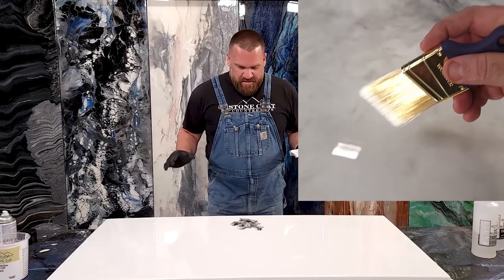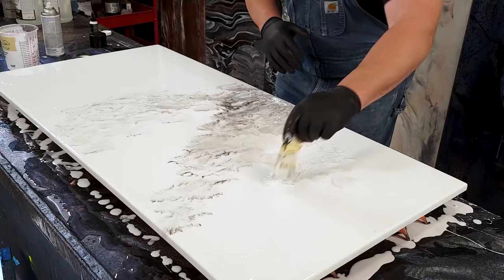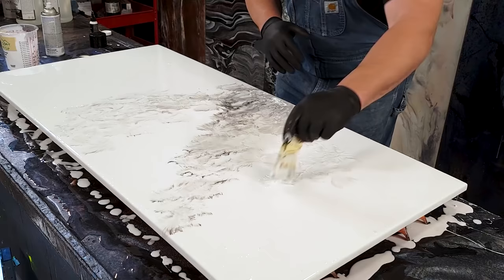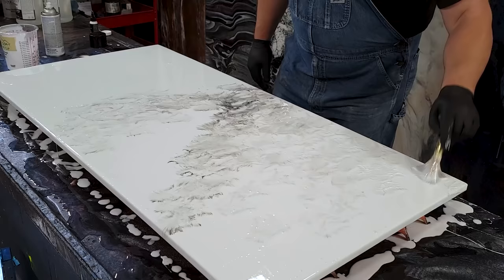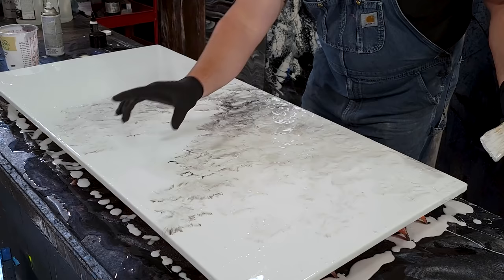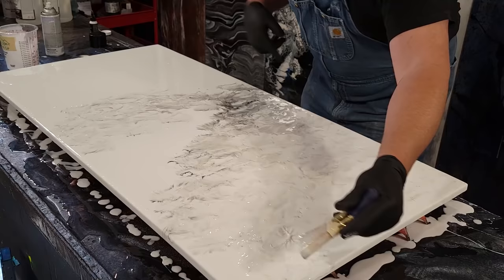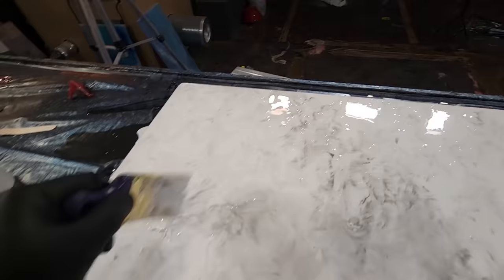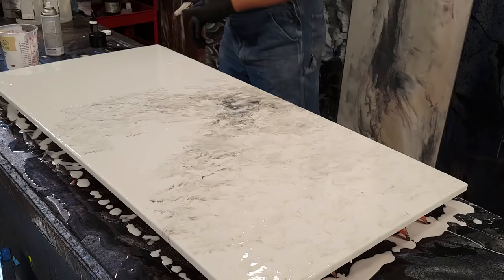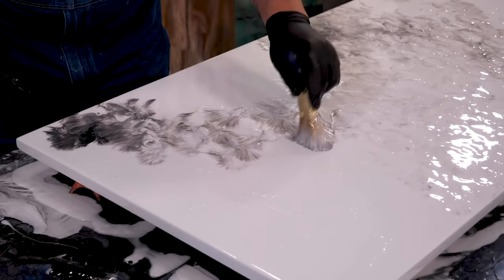You feather out that color — if it's too dark, grab some white and bring it back on top to gray it out. You can also see I'm not chopping every section; I'll grab the dark sections and bring the color over to the lighter sections. You don't want to leave any spots that are too white and you don't want to leave spots that are too chopped — just feather that. You have tons of time to get this project to look the way you want it. I'm focusing on using the heel of the brush; that gives me the most realistic pattern. I'll come smooth and feather all this together with a blow torch or a heat gun. I love how subtle it is — it's really beautiful.